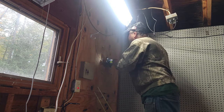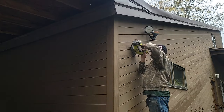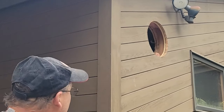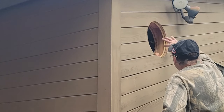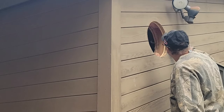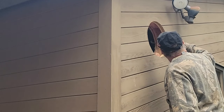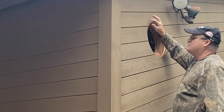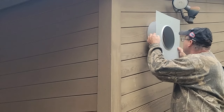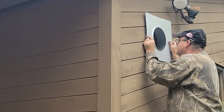The holes line up nicely. It's nice having house sheathing that's an inch and a half thick — that's a pretty thick wall. I said half-inch plywood on the exterior, but it's five-eighths. Then there's 30-pound felt paper, then Tyvek, and then a heavy three-quarter inch cedar tongue and groove. So that's pretty nice. The collar would mount like this — see how she fits. Pretty nice.